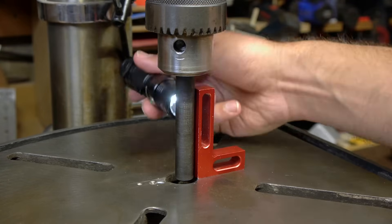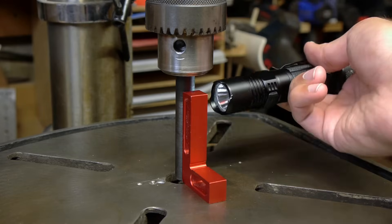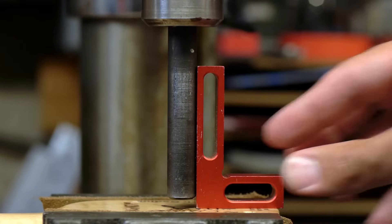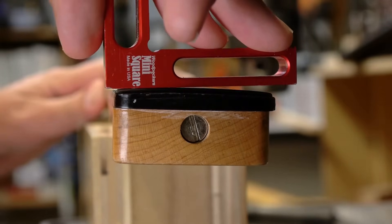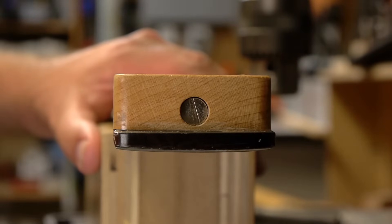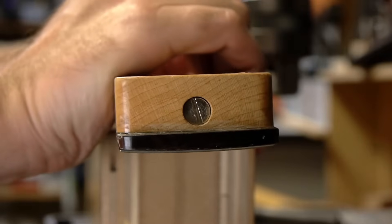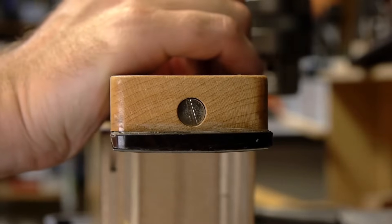Once you've set the table, double-check for squareness along both the x and y axes to make completely sure that the table is square to the chuck. We'll be repeating the squareness test with the square on top of the neck heel, which is mounted in the drill press vise. The reason for testing squareness again is that guitar necks have radiused fingerboards with radiused frets, which means they have a curvature. Unlike a perfectly flat piece of tool steel, when you place a guitar neck face down into a drill press vise, it might pitch up or down vertically, or roll side to side horizontally. If that happens, the neck heel is not square to the chuck, and the holes you drill will be lopsided.